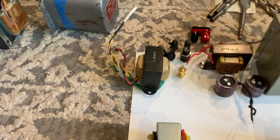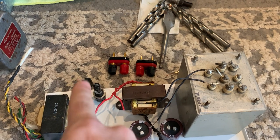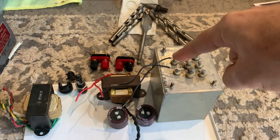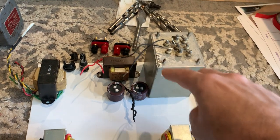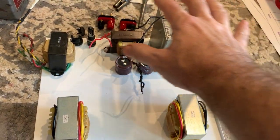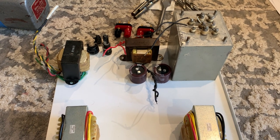And they end up right next to your power connector — they also put the speaker connectors in the back. So everything is there, maybe with a little bit of distance between them. But what you have is the lowest level signal being affected by the line AC — 120 volts or 230-240 volts. Your low level signal has to travel from the back up to the front, all the while going through the vicinity of your power transformer, your high voltage supply, your filament supply — and it's picking up noise from all of that. The power supply section is making all the noise, and you want to keep the fragile signal away from it at any cost.